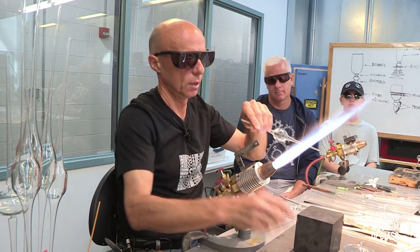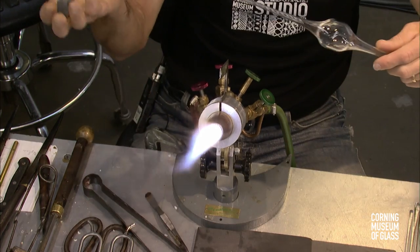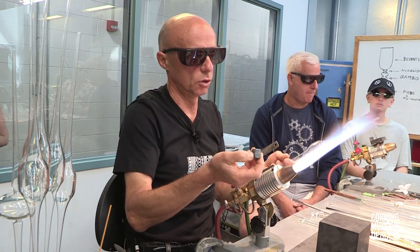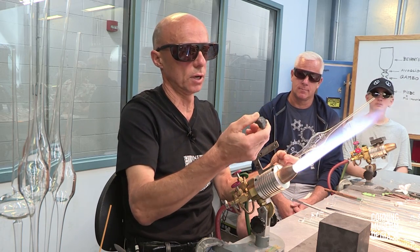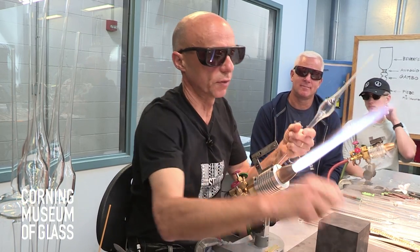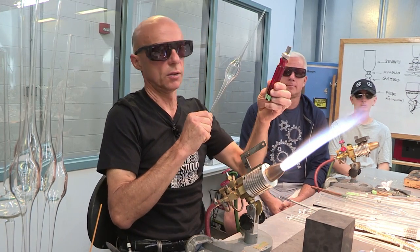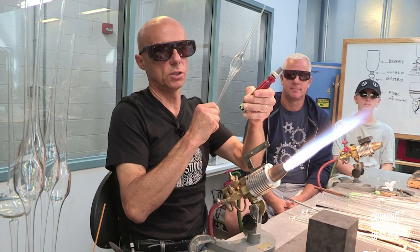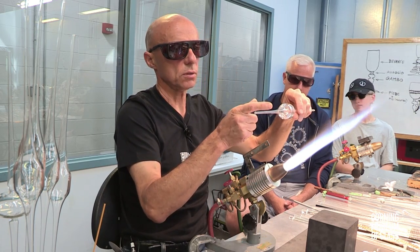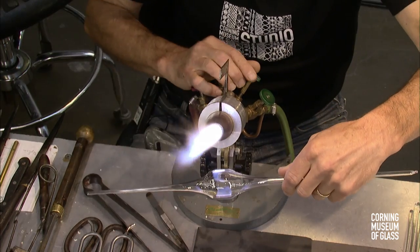Next step is cutting open one end and fire polishing it gently. For cutting I use a piece of carborundum — a grinding stone where you sharpen your knife. You can buy a little bar of it for about five bucks and it will last you the rest of your life. This is good for thin pieces — scratch and break. For heavy wall pieces you use a carbide steel. Then I'm going to create two constrictions, one on the left and one on the right — exactly what furnace workers do. I work under the flame.